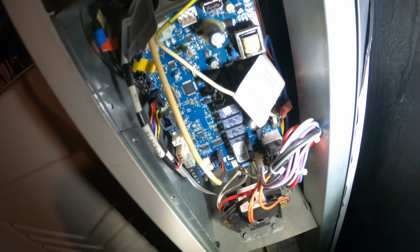Okay, so opened up the wire harness, traced it back. And this is the thermistor right here. This is the piece right here. This thermistor sitting on this part of the evaporator, and that's T4. So T3 must be the one right below it. But we're here for T4. Let's open this up and see what's behind there and begin to see what's going on.